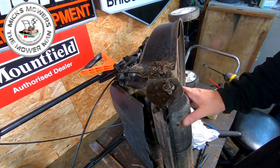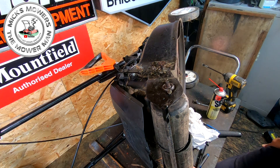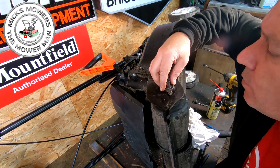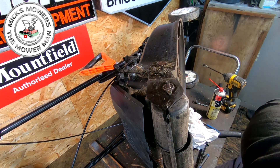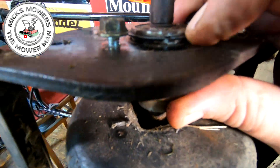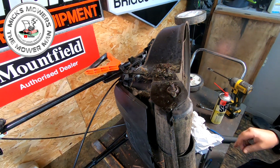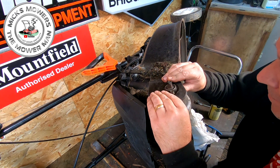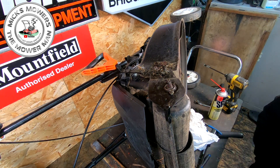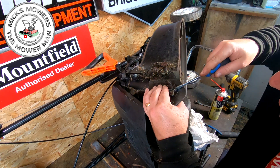Now I'm hoping if we can withdraw this it might want a bit of a punch — it's got bearings in there. That shaft — oh hang on, that wants to lift up. That bearing — is that a circlip on there? So it's got like a little tiny keeper plate on here. You can't just bash it out. On here there's a little tight — it's a bit like a piston ring, for a better word. A bit of a piston ring there. So without that piston ring removed you won't get that off. I didn't know that was there until I looked. I'm guessing that piston ring is going to stop that bearing from doing what it needs to do.